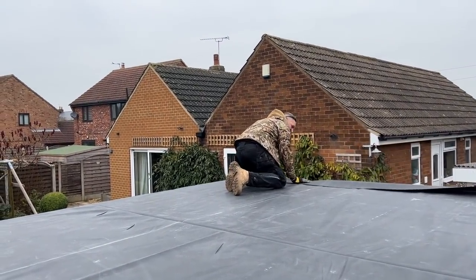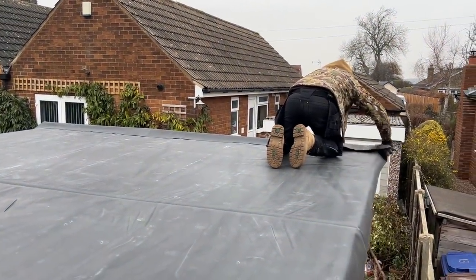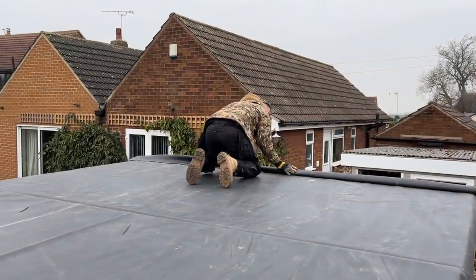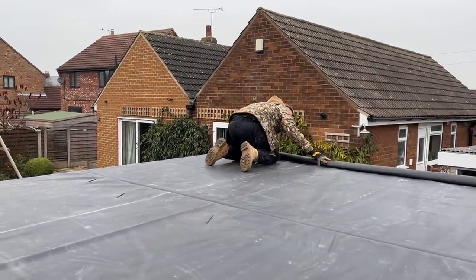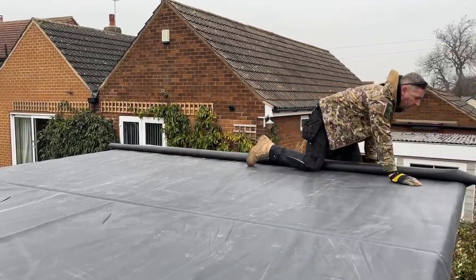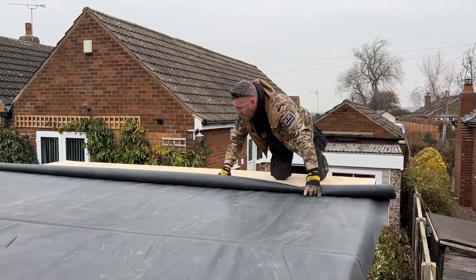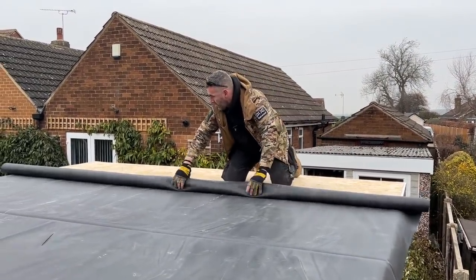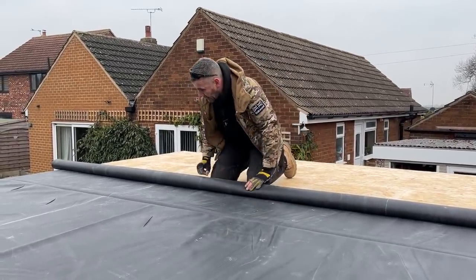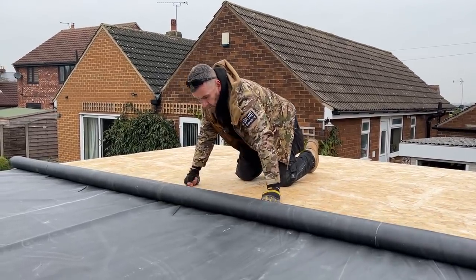You need to be cautious that you don't step over the end of the building where you see the rubber — because there's actually no roof there. So I'm going to fold that over in half like that, fold it again. The tricky part is watching that it doesn't roll back on you. I'm going to roll it like you would a carpet. If you leave loads hanging over the end that happens consistently and that's the problem, but once you get to a roll like that you'll find that it's quite easy to roll. Keep it relatively tight and keep it parallel to the building.